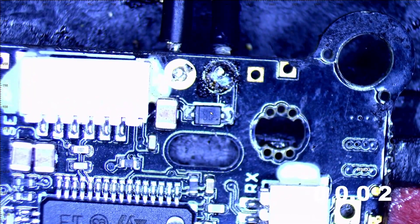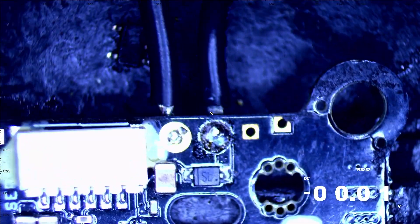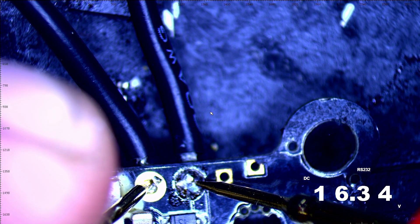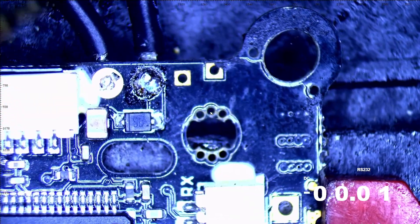We'll disconnect this board and remove it. Here's another board — this one actually has a bad microcontroller unit. I'm going to power it up the same way: ground in and power on. This board is now powered by the same voltage. I'll check to confirm — 16.34 volts coming in. Ground is set. Now let's touch this side of the diode — 16.34 coming in. Let's see what's coming out of the diode: 16.13 volts.